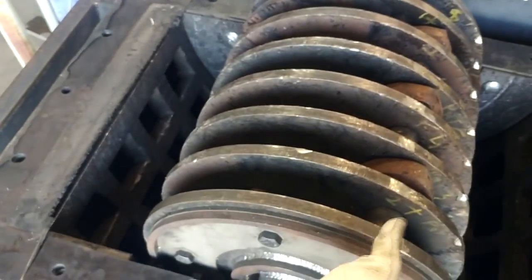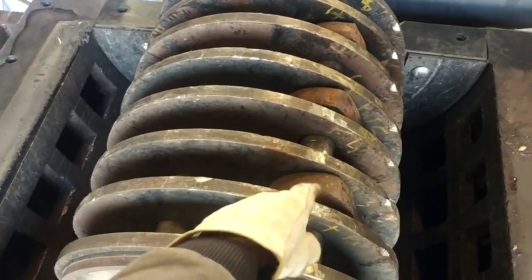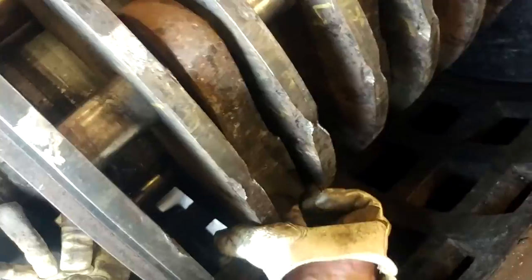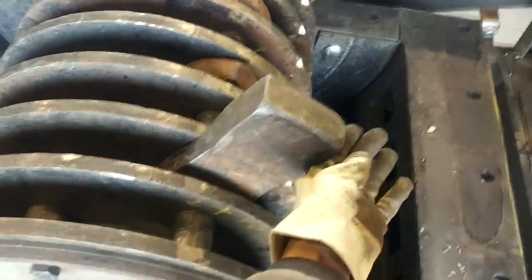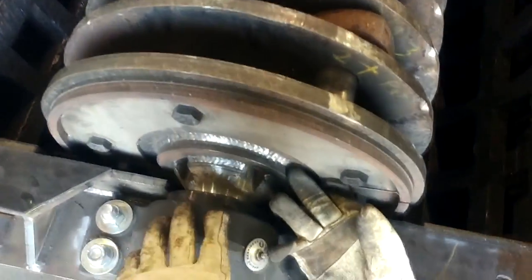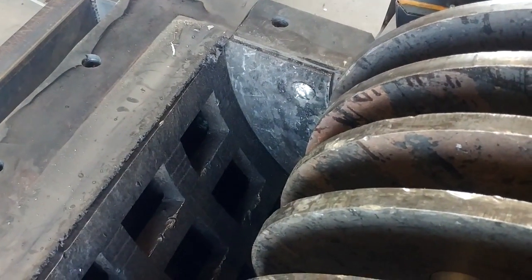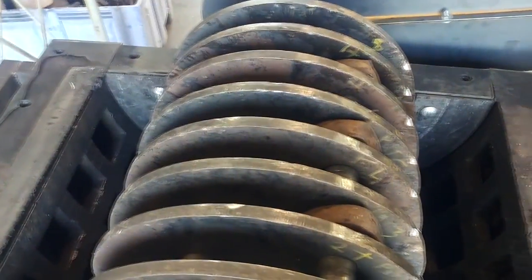We've taken the cover off the hammer mill — there's the screen with those four inch holes. This is the rotor and we have two rows of hammers: one row has three hammers and the other side has four hammers that are staggered and offset from these three. Here are the hammers we're using — they're manganese steel. There's the discharge chute down there. I believe this is a five and a half or six inch shaft with big double spherical roller bearings. The whole mill has armor around the outside of the case so that you can replace it once it wears. When stuff goes in, it gets beat up and comes out the bottom.